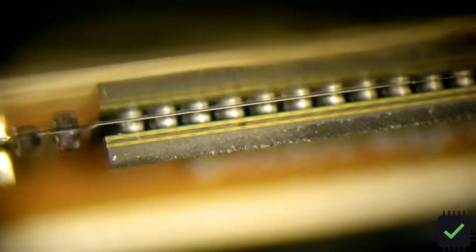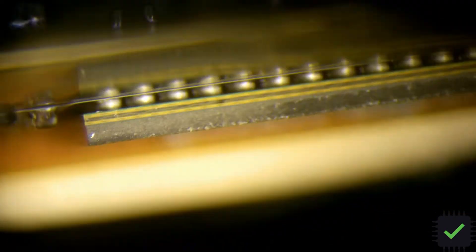I'm gonna add some light so it's more visible. This is the memory chip I was talking about. It's really hard to tell, but I don't really think there are any issues there. That's the corner close to the crack and it seems to be fine — but it might not be. I might need to remove it and reflow it just to be 100% sure.